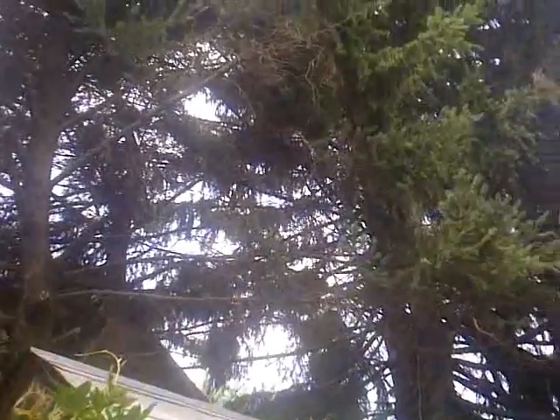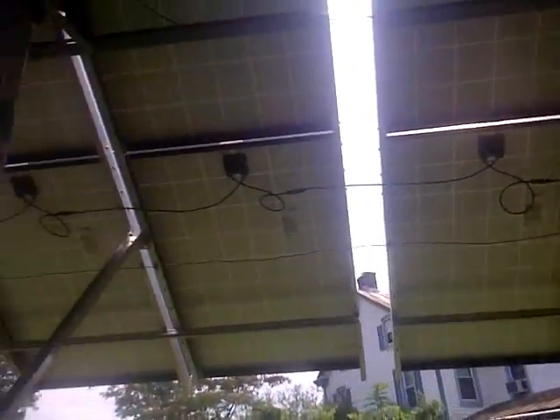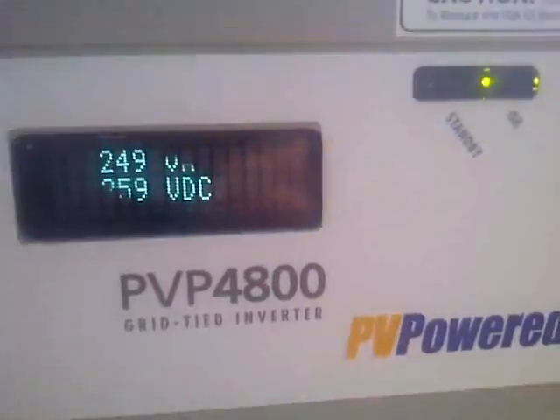These are up pretty high — it's six feet from the edge down to the ground. No wind loads really to be considered in the back of the array because of all the trees. It does face south, so he's got a good shot towards the sun. This is a state qualified system — we filed all the paperwork and he is getting paid for this as well. I'll take you over to the inverter and see what we're putting out.